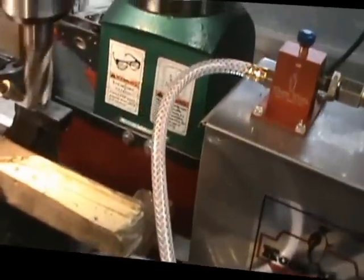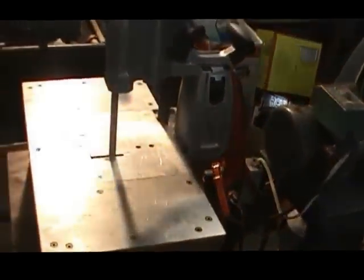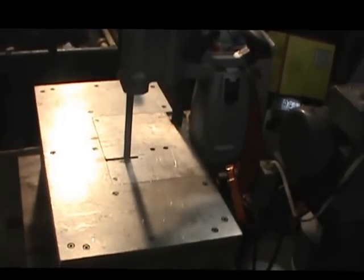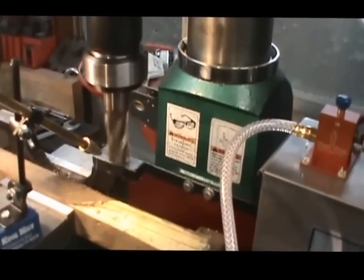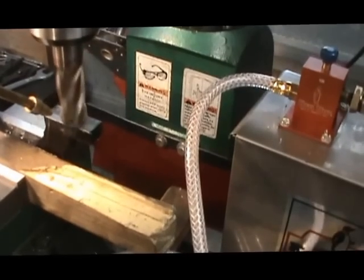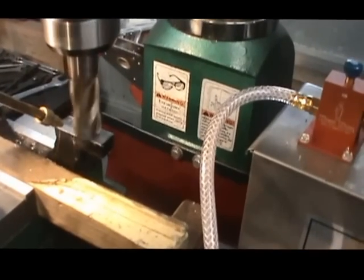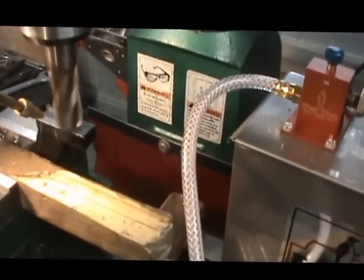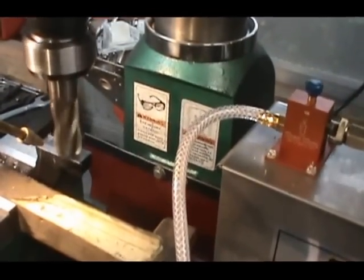We've set up the clutch collar and cut it in half on the power hacksaw, straight in half at the horizontal center line of it. Now we've brought it over to the milling machine and we're milling about 20 thousandths from the joint. We'll take a similar amount on the other half, and then we'll have to drill for bolting those two halves together. So we'll leave you now.